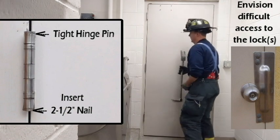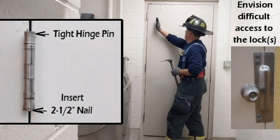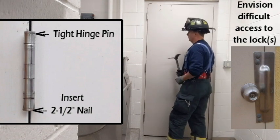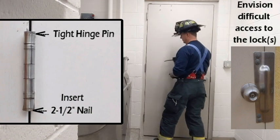The reason why you start from the bottom and work your way up is if you start from the top and work your way down, that door can start to drop away from the jam, and then it'll create torque on the middle and bottom hinges, making those pins more difficult to get out. If you start from the bottom and work your way up, the door kind of stays in place and gravity works in your favor.